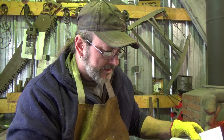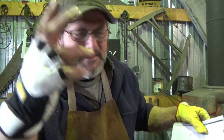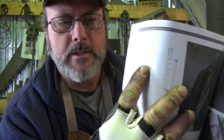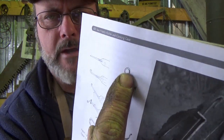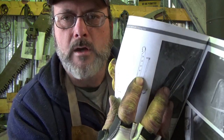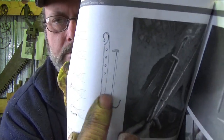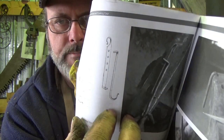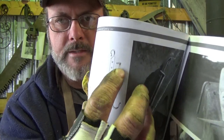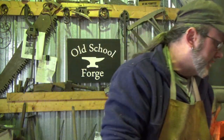He walks through what you need to do. He recommends a 24-inch piece of the 1-inch stock, but in reality it's based on what length you want. First, taper and draw out the hook, make the top hook offset a bit so the center hang is in line with the holes — otherwise your pot might be cockeyed. Then determine how long you want it, cut off the bottom, punch the holes, bend out the bottom piece with a hole for the hook pin to slide into, and make a small hook with a taper and a 90-degree pin on the side.